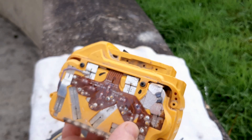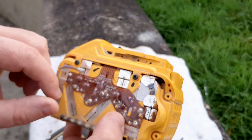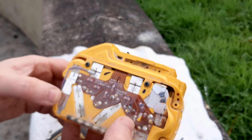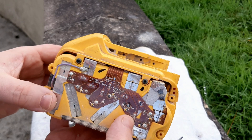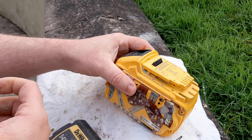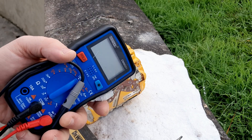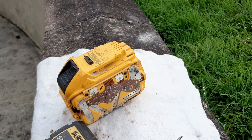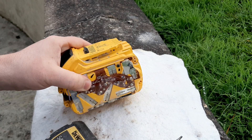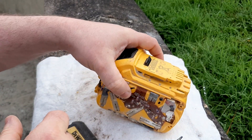If I tack a bit of nickel strip on and put it together to see if it charges — though that might have burnt out for a reason, that cell could be defective. I've tested all cells with a voltmeter and I can't see one that's identifying itself as defective, so we're going to go back to this and spot weld a bit of nickel strip onto that.